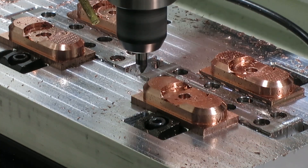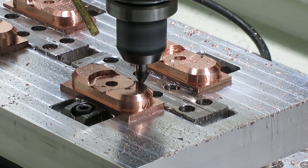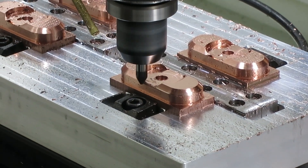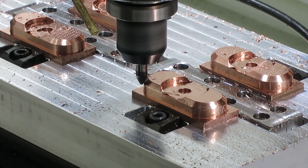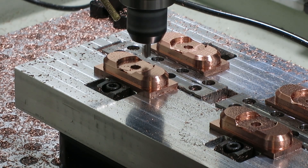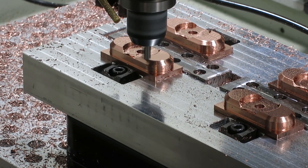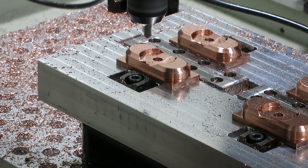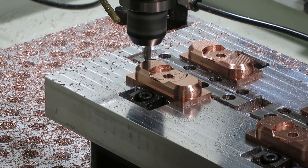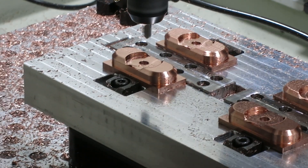This next pass is the small micro chamfer that is at the bottom of the big chamfer — it's kind of hard to see, but it's really easy to feel. You can kind of see the light glinting off that one there. Then I do the same micro chamfer on the top with different angled cutters, going around the outside. I also put a tiny little micro chamfer on the inside.